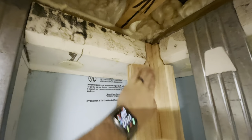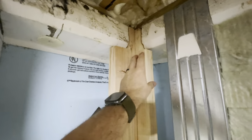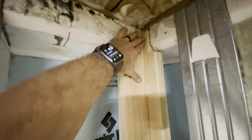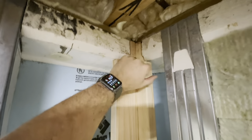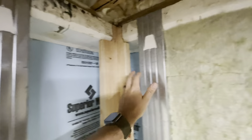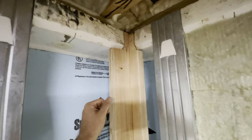Now you can see how these go together in here. I know this is only like an inch, so it doesn't seem like a lot that's going to be connected up here. But once I get these screwed together — even right now — this stuff doesn't really move. These kind of sandwich each other in here, and especially once they get screwed together, it's not coming out. It physically can't come out past the insulation. It doesn't have to be structural in any way — the wall is your structure. This is really just going to be here to fasten your wall material to.